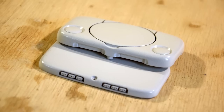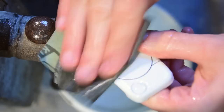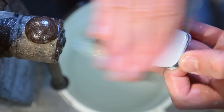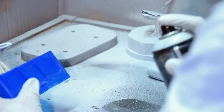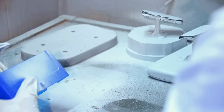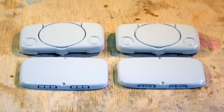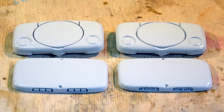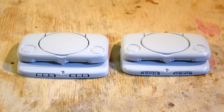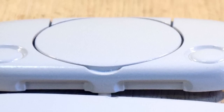Thus, before the following coats of paint, the case is water-sanded again. Much like before, the last coat needs to be a wet coat — thicker and evenly spread. It looks like this final coat of paint should be enough. The case looks smooth and detailed as it is. It seems the paint didn't manage to go all the way through the disc seam, but actually it looks good like this — it accentuates the detail of the lid.